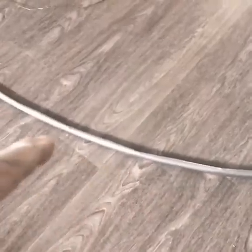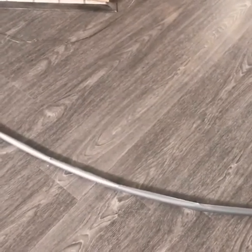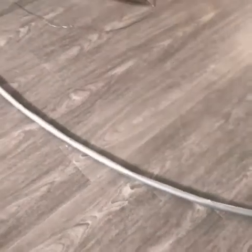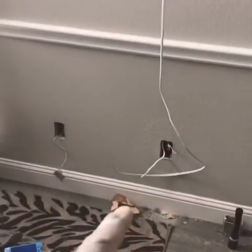Yep — that is a broom handle, one of those little metal broom handles. I took it and bent it every five or six inches so that it can curve through the wall. I can't use it as a broom handle anymore, but it was the only thing I had available that was strong enough to push through all the foam and insulation in the wall. I kept beating it down — boom, boom, boom — it went all the way through. I stuck my hand up through the bottom hole, felt the bottom of the broom handle, pulled it all the way out, fed the wire through, and it came right out the bottom no problem.